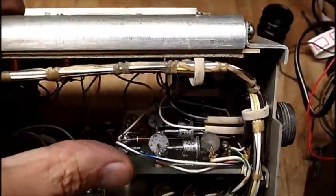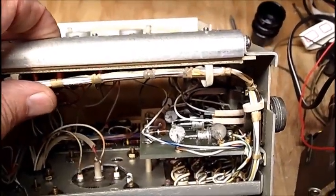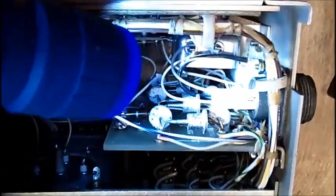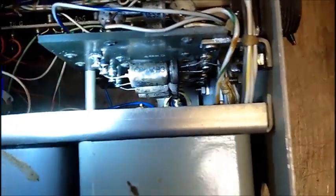I found one capacitor I'll have to turn it over to show you. These are all rectifiers here — they all got coated corrosion on them. I'm not sure if you can see that, but look at these diodes here — there's corrosion on them, you can't really see them well. These are the electrolytics down here, there are four of them.